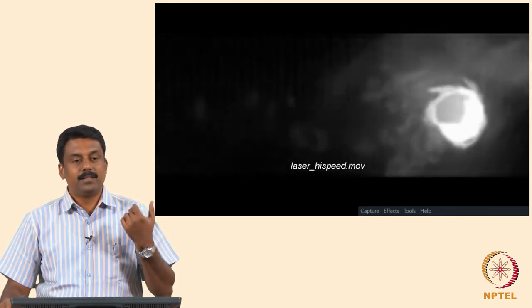In summary, we looked at the fundamentals of lasers — types including solid-state lasers, gas lasers, fibre optic lasers, and diode lasers. We looked at a typical laser welding setup, the weld pool and keyhole behaviour from the laser's perspective, and why keyhole stability is affected. In the next class we will see what causes stable keyhole formation and how to balance the forces involved.